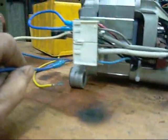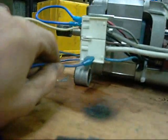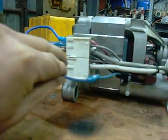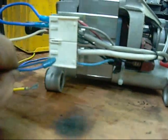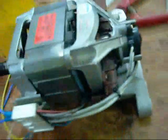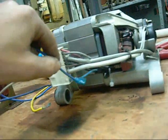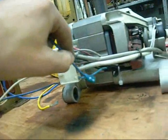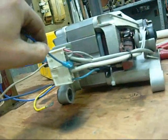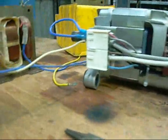The power is off at the moment. I've got active going through the blue wire — alternating current, doesn't really matter what your polarity is. One of the live wires is going through the blue lead. The second live wire is going through one of the brushes, which is the far side in this case. I've bridged from the near side brush to the other side of the field winding. Red and blue are the field windings, and there's also a midpoint to them for speed control.